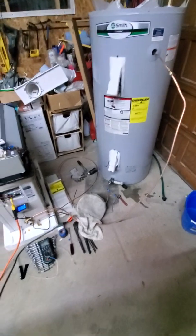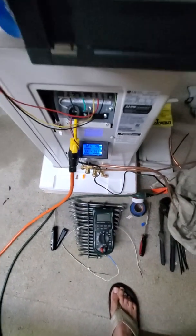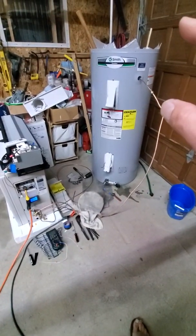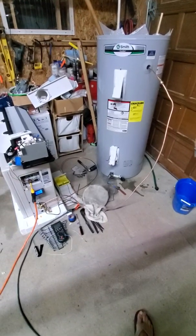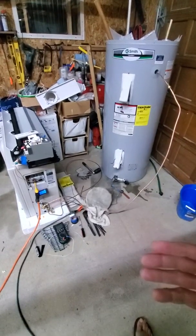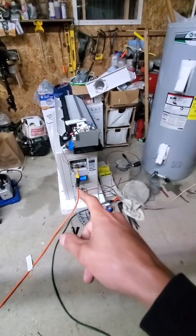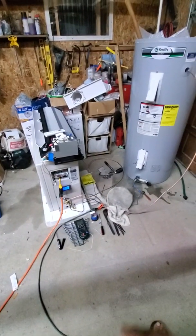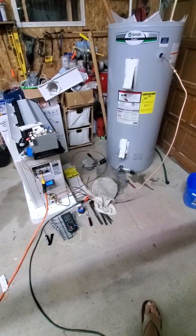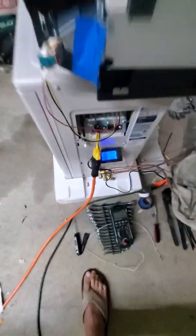I should have calculated this beforehand, but I'll put it in the notes. The amount of power we used was 936 watts times 2 — about 1,850 to 1,900 watts. We went from 56 degrees to 122 degrees in one hour. I'll put in the notes how much power that's equivalent to — 70 gallons with that temperature rise — how many kilowatts that normally takes. We used 1.9 kilowatts, so you'll see the coefficient of performance. That's at 65 degrees ambient, which I'd say is the average here in the upper states year-round.